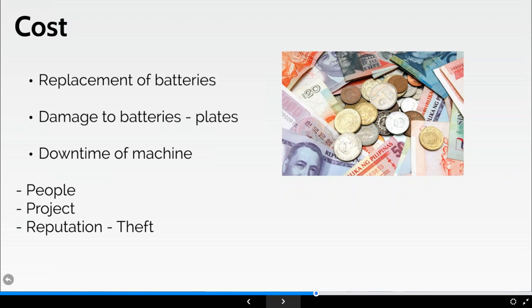And again, it's a process where you finish your shift, you find your charge, your parking area, the charging lead, you plug it in and you forget about it. Oh, how wrong that is. Checks should be carried out on the machine post-shift, which includes the batteries, because when this machine has been on charge and when it has been working, the deionized water that's in there is going to evaporate.